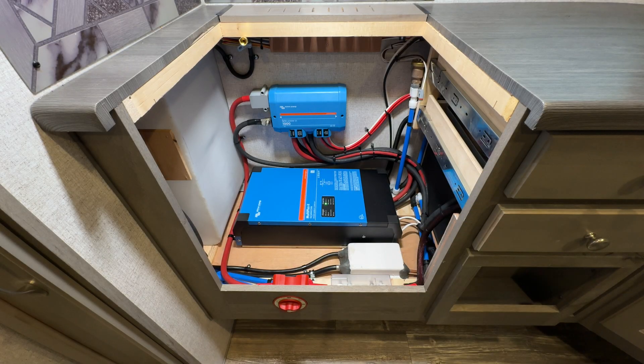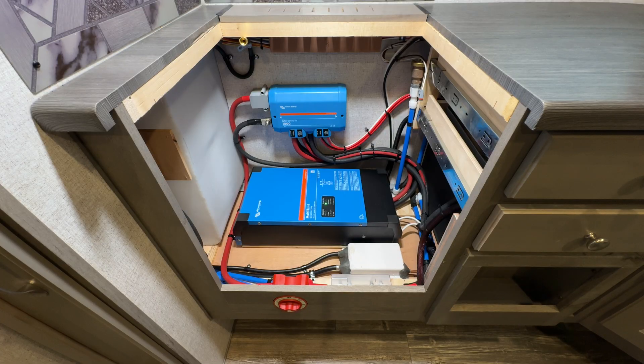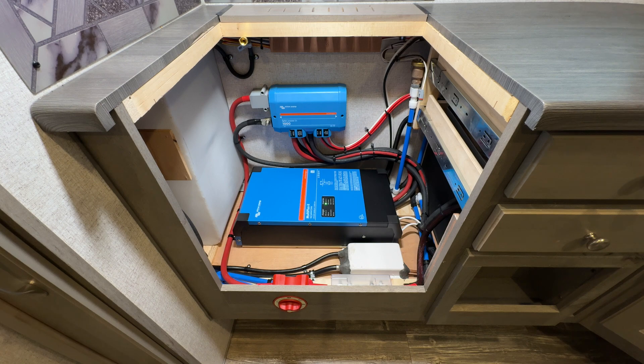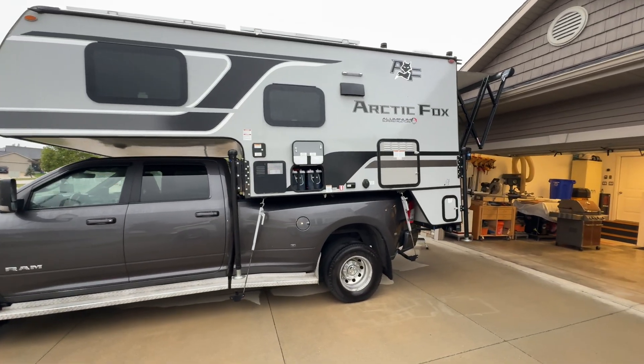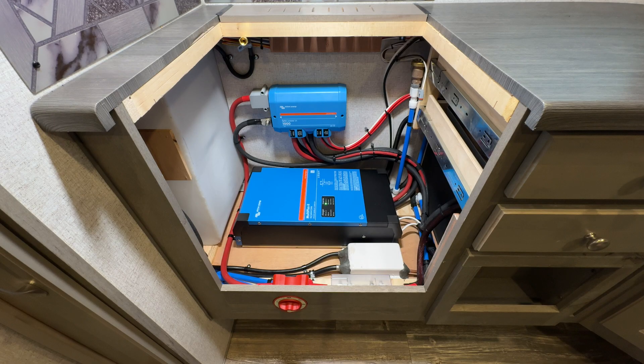Next, we've got our solar input with a 60 amp fuse. This camper has 600 watts of solar on the roof and a 100-volt, 50-amp MPPT solar charge controller. That charge controller is located up in the closet. From the factory, these solar leads are unprotected at the battery — they were just hooked directly to the battery — which is not correct. We want to make sure those leads are fused at the highest potential, which is at the batteries. That's now solved with the way we've done the install. From the factory, the three 200-watt panels on the roof are wired in parallel. We decided to reconfigure those so they're wired in series. That gives us a little better low-light and shade performance. Even a day like today — it's extremely gloomy — we were still able to pull about 25 watts with barely any sun. When it was wired in parallel, the solar was basically shut off. So that should give him a little more input early in the morning, later in the evening, and in under-shade conditions.